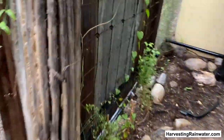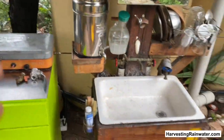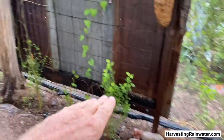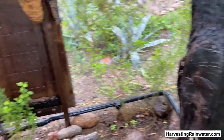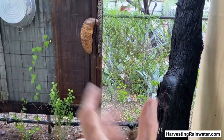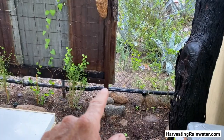And then at the end, to the yellow orchid vine. Now you don't have to have that pipe exposed in the air — it could be in the ground under a raised path. But I'm keeping it high because the whole thing works with gravity. The higher I keep that pipe from the get-go, the longer the run I can have to disperse that gray water to more points.